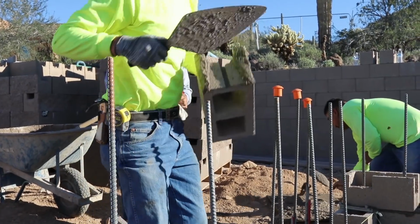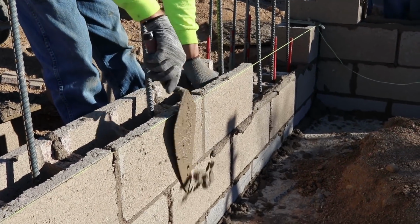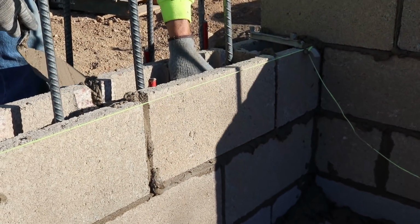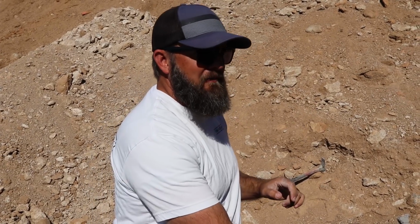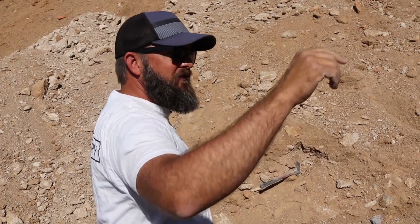I know you can feel it, but is it as tight as you can pull it? This one, because it's not very long, you don't got to get crazy. But if we had 20 or 30 feet, I mean, it's a guitar string. Super tight. And on occasion, a trowel will hit it and sever, and then it is a boom, like the line will just snap and go 20 feet in either direction.